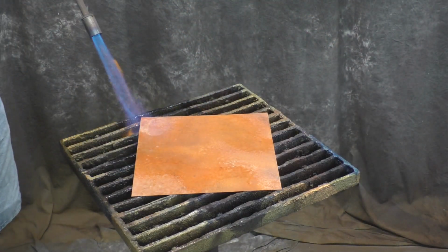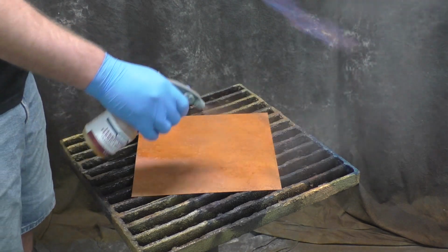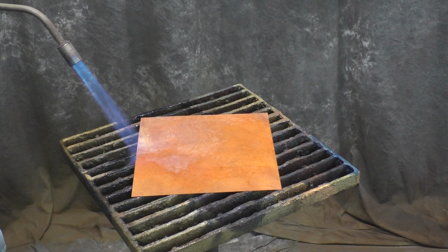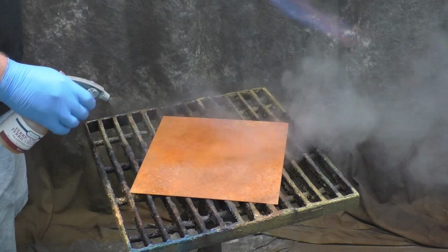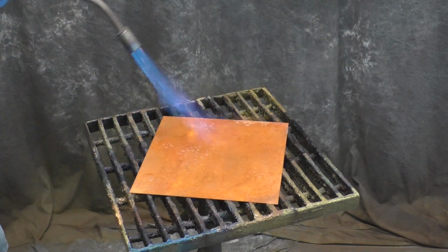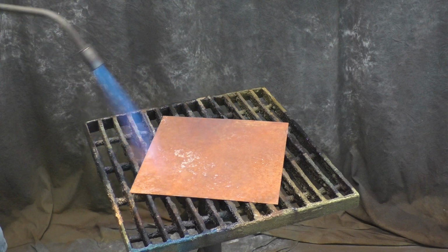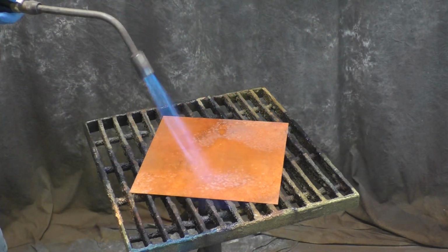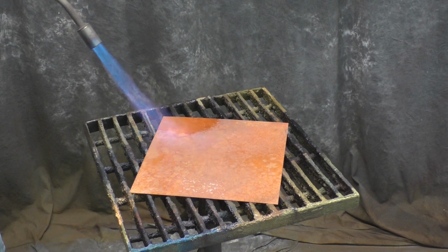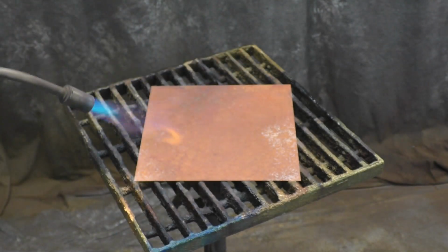And typically what I go for here is I'm just trying to get kind of a more solid color throughout. For a base patina, that's your goal, is to not let it look like a copper penny anymore. You just want it to change the color, and ultimately you want to see kind of a layer. You want to see multiple colors coming through on something like this, so that when we go in with the cupric nitrate on this next step, we don't start with a bright copper finish. We're going to start with this muted down, kind of brown, so it already looks a little aged, a little antique-y. So if we don't do a solid opaque coat of the cupric nitrate, what we see through is the ferric nitrate, ferric chloride base. And that's one of the big reasons for doing a layered hot patina process.